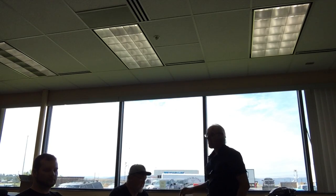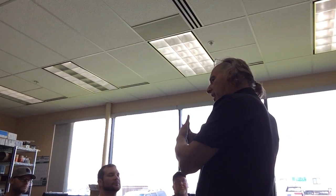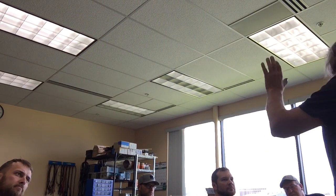Okay, so here we run into something, so everybody stop for a minute. He measured his voltage on his battery, but he did it open circuit. Then he put it in the load, and what happened to the voltage? It lowered. And he proved that because he measured 8.13, and I measured 8.39. Same thing happened to me. But when he put it in the circuit, it's 8.12. That's close enough. So remember, there's an open circuit and there's a closed circuit. When it's open, the battery is always going to be this, and it's going to draw down to this. So don't get confused on that. Okay? Good. Go to work.